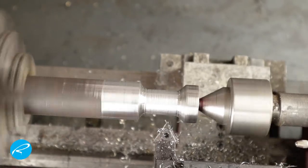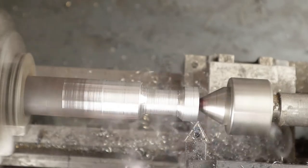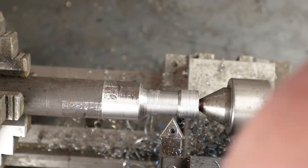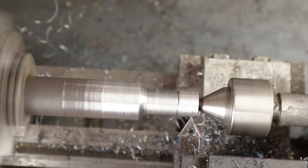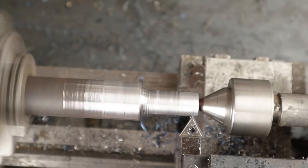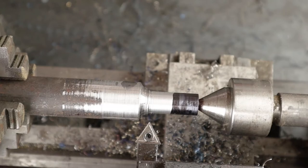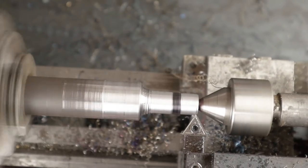Here I'm working on my lathe. I've got a piece of metal from my scrap bin — it's probably just mild steel, nothing special. It doesn't cut very well though. I'm using a carbide cutter and getting a lot of smoke and chips that won't break, but my feeds and speeds are probably not set correctly. I'm not really much of a machinist; I'm an illustrator by trade, so I'm kind of just winging this as I go. Because of how far it sticks out, I've had to use a live center in the back, and because of that I'll have to make the stem much longer than needed so that when I round over the end you don't see the hole where the live center used to be. I could probably do some of these angles with a form tool — actually grind a high-speed steel cutter for that curved shape as it gets toward the flat head of the hammer — but that's more work than I want. I'm just doing this quick and dirty to get it done. I've still got to make the actual graver, and I'm thinking about making a ball vise kind of thing rather than buy one.